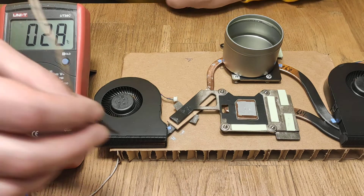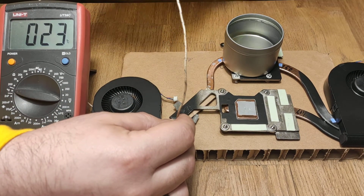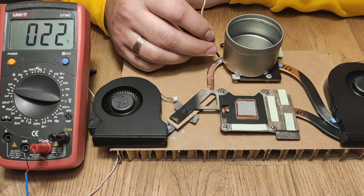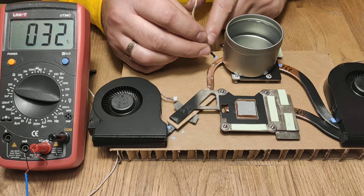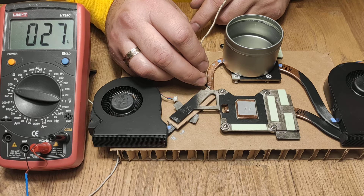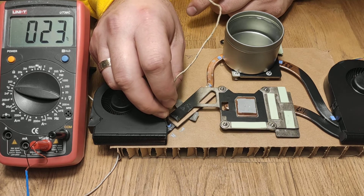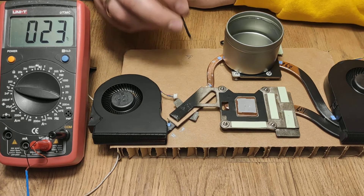But now let's see the temperature here. Surprisingly it's just 22 degrees — it's like heat is not traveling at all in this pipe. It's quite hot here: 32 degrees. Then here it's still hot, 27 degrees. But here, temperature is dropping. It's weird — it's like this smaller pipe is not working actually.